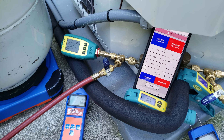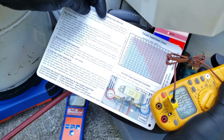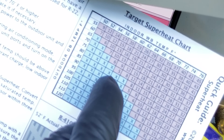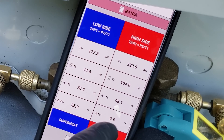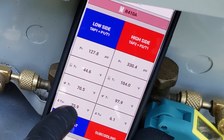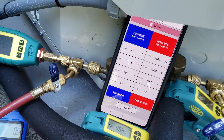The system has been running for about 12 minutes now. Our indoor wet bulb temperature was about 64 degrees and our outdoor temperature is presently 90 degrees. Taking 64 over to 90 gives us about 9 degrees as our target superheat. We have an actual superheat of 25.9, so that means we're undercharged presently, and we have 5.9 degrees of sub cooling — a little low. Even though we're undercharged, I'm first going to recover refrigerant to show you how superheat increases and sub cooling decreases.